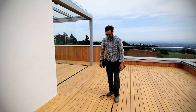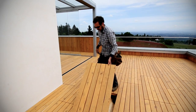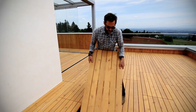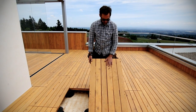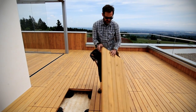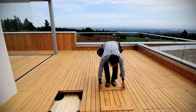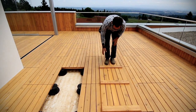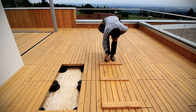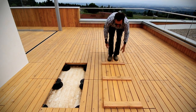Here we have our roof tiles. We made these out of some FSC cedar. We purchased the product kiln dried and had it pre-finished on six sides. We basically cut all the pieces and fit them into a jig we made. We'd lay the individual pieces into the jig, set our dividers, and nail the pieces in, giving us this nice little 2x4 roof tile.